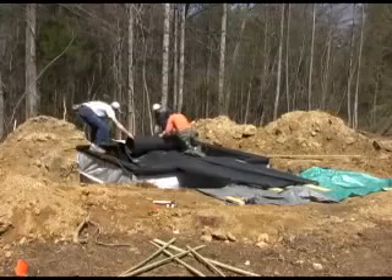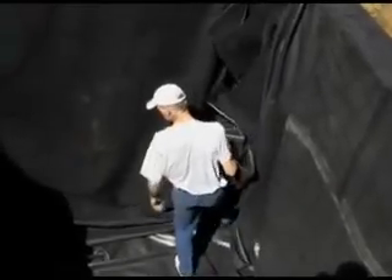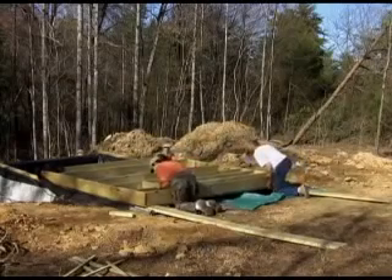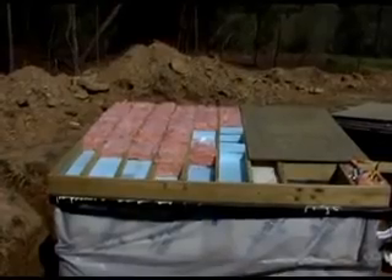The box is lined with a felt liner before installing an EPDM pond liner to hold the water. A 30-foot square pond liner weighs over 400 pounds, so get some humans to help you out with it. I also lined the top of the box with a pond liner, and after it was carefully heaved in place, I insulated the lid with both foam and fiberglass insulation. Inside the box, you can see how I used large stainless washers and a lot of screws to hold the pond liner to the lid.